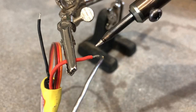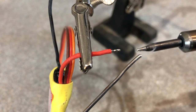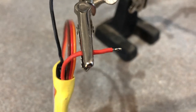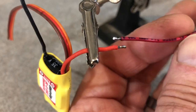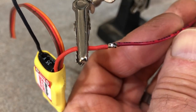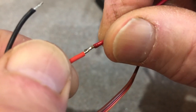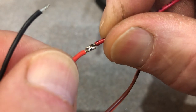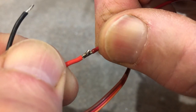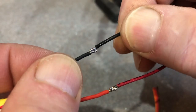So the first step is to tin the wire, and we do that with just a little bit of solder. I have my other piece of wire pre-tinned, but I want to put a little bit of solder on the soldering iron so that when I bring in the other piece, I have a little bit of extra solder to solder the two wires together. And there we go — that's a good solder joint. You can see that the solder is fully connected to both pieces of wire. It's shiny, it's not oxidized. I could have had my wires a little bit more parallel, but this will be fine. Now I've got both wires soldered; the black turned out pretty nice as well. That's a good, strong solder joint.